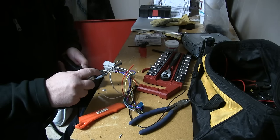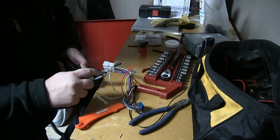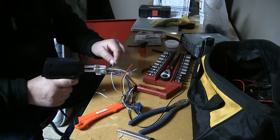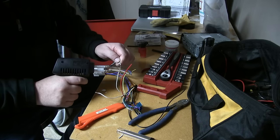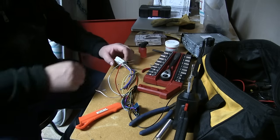So I'm doing that, heating it up. Someone that solders every day and does a lot of electrical work could probably do a lot better job with this than me. But whenever I was doing it, I did get a lump on there, kind of heavy on one end. If you do that — and you'll see me do it here in a minute — just rub it in where it's not real lumpy. Because remember, we've got this heat shrink we've got to pull over this connection, and if there's a huge lump of solder sticking there, it's not going to slide over good.